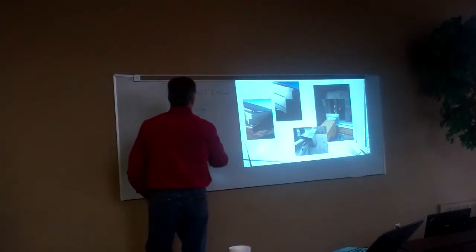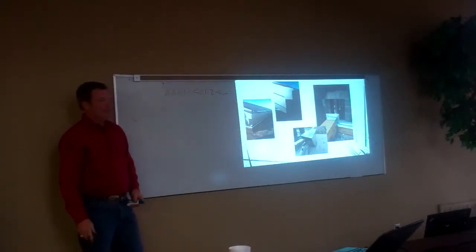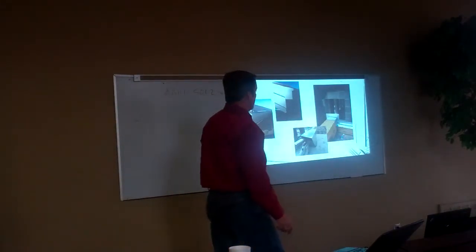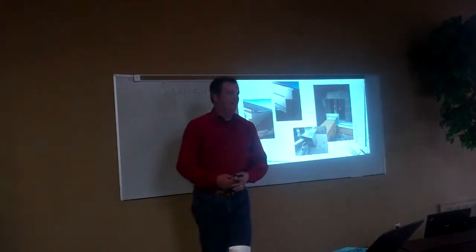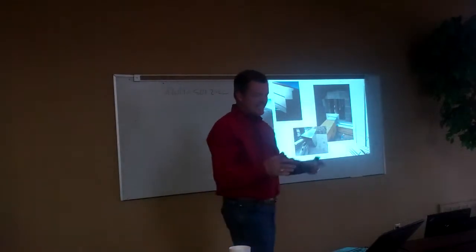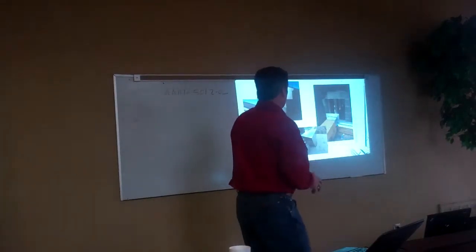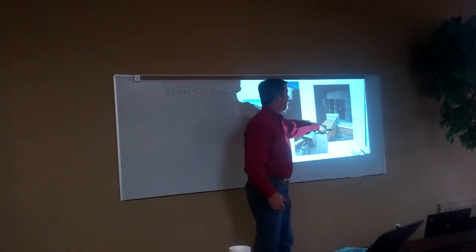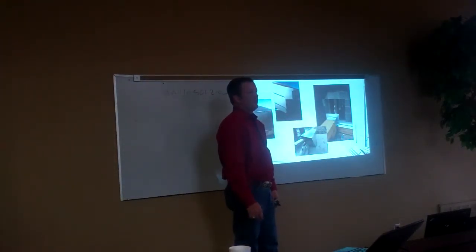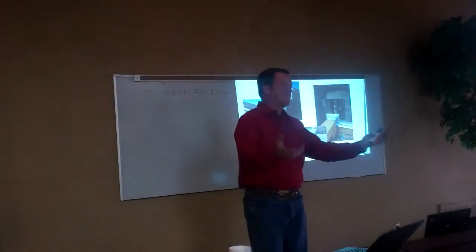This one's my favorite. Can anybody tell me what's wrong with that picture? There's a window in the parapet. And what's cracking me up is they went ahead and flashed it all. Pay attention to your working surroundings — that's my point for these guys. If I'm the guy putting this rough carpentry on and then I go back in and set that flashing, I'm thinking: wait a minute, there's a big void in the wall here, how's that going to work? Somebody should have asked a question. Get the subcontractors to start asking questions.